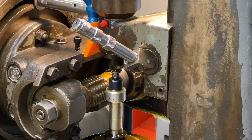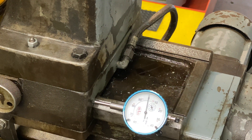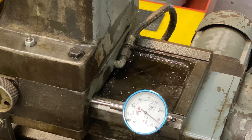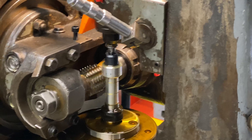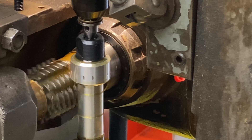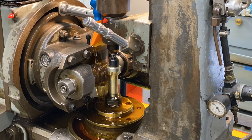What's going on here is we are touching off, seeing the little marks and counting them to make sure our change gear setup was correct. We're setting our tailstock so we can put in the working depth of the tooth, which is written on the hob. It's time-lapse — we're climb hobbing the pinion, all the marks are confirmed. This just takes a few minutes in real time; we are sped up on video, but this is the pinion start to finish.